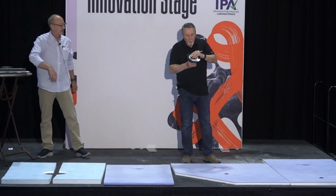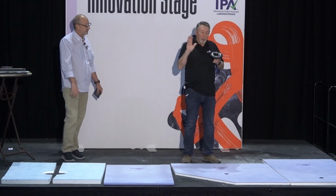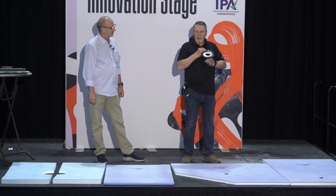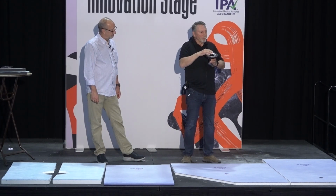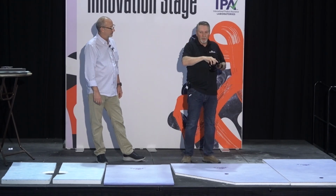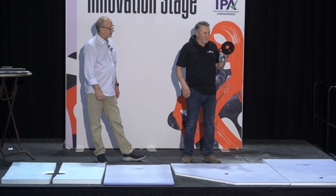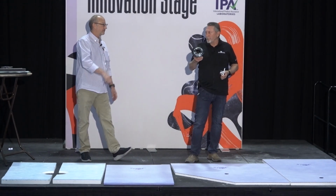So we have what we call our Freestyle thin bed drain. It is not a bonding flange drain, it's a clamping ring drain. It's a three-piece with a strainer that screws in, but you're going to direct bond the membrane to the drain, and then tile from there. We went with the clamping ring because we know a clamping ring is bulletproof. It comes in ABS or PVC, and you glue the pipe to the drain because we know a glued fitting, you never have to worry about it. So that's a very thin clamping ring, and we're still going with a thin set or thin bed method. Correct.